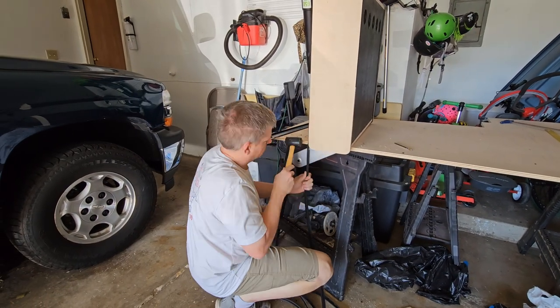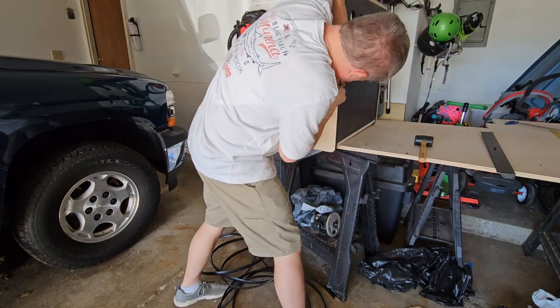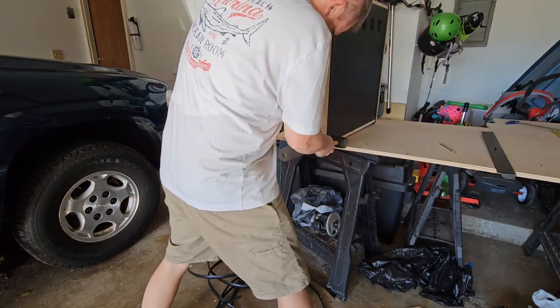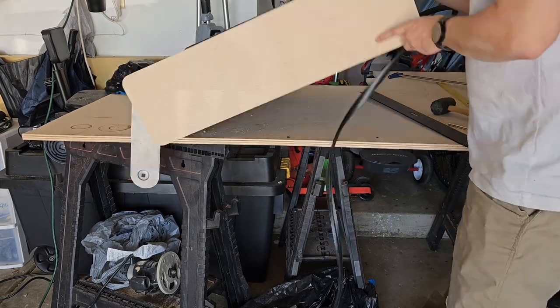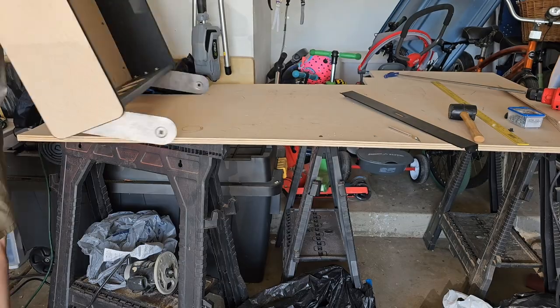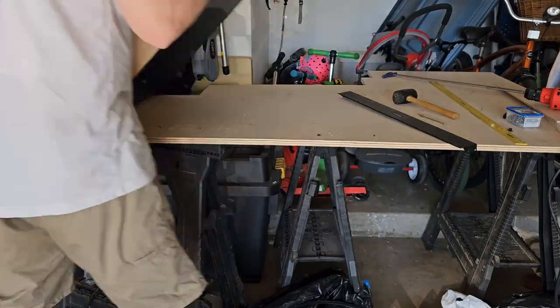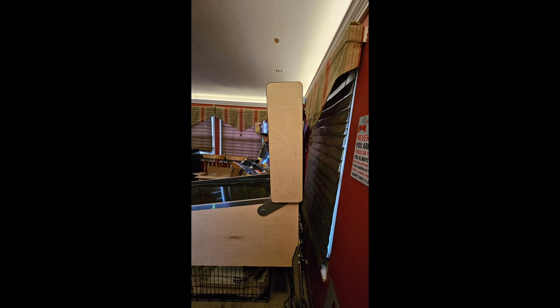I then added the T-molding to the side panels. When it came to the corners I had to cut a couple of V-shaped relief cuts — about three or four — so that I could round the turns. Once I got to the end I trimmed it off a little bit and made sure the seam was hidden. I then took it inside for a test fit. In the next video we will attach the cabinet and begin installing the rest of the components. If you found this video entertaining or helpful, please give it a like, subscribe, and share it with your friends to help the channel grow. Don't forget to ring the bell so you know when the next video comes out — thanks for watching!